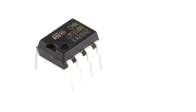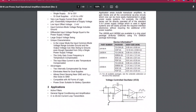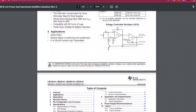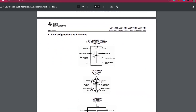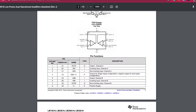I'm gonna use this LM358 IC in this project, which is a high gain amplifier. The LM358 series are operational amplifiers which can operate at only a single power supply voltage, and they have two differential inputs and remain in the linear mode with an input common mode voltage of 0 volt DC.